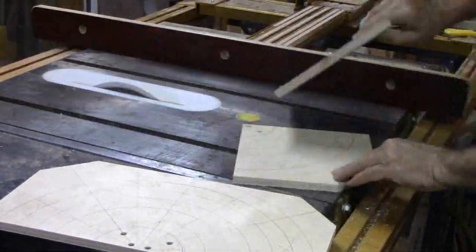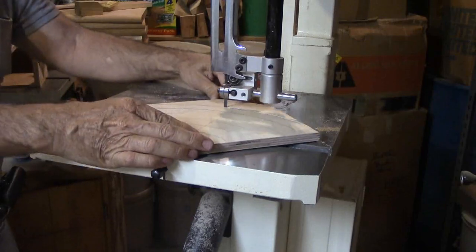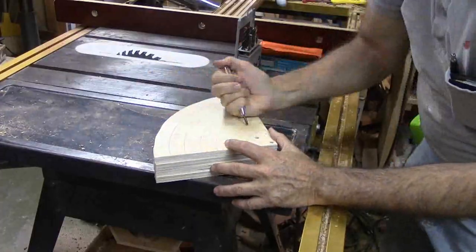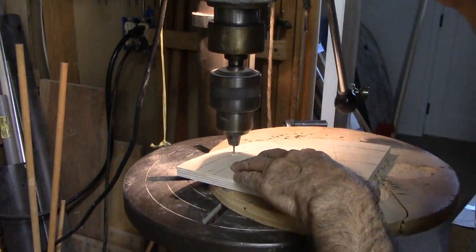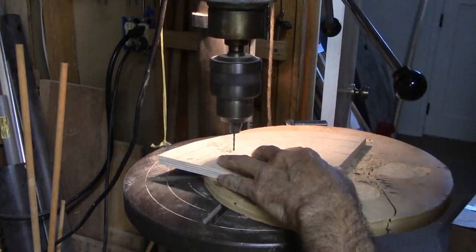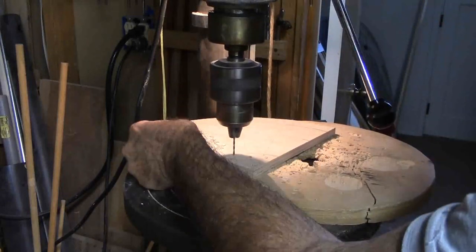This is why I did not want to shape the jaws earlier, then shape the jaws on the bandsaw. Now I could center punch all the intersections for posts. Now that the jaw pieces are smaller, I can use the drill press to drill all the holes. I'm also drilling holes at the 45-degree lines.